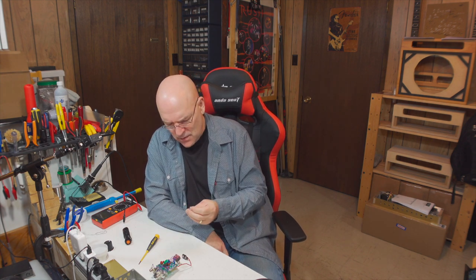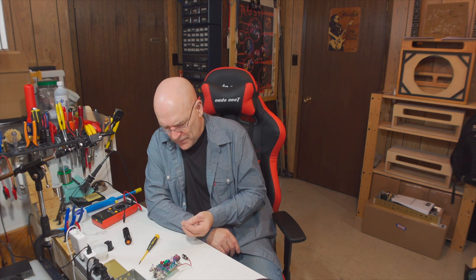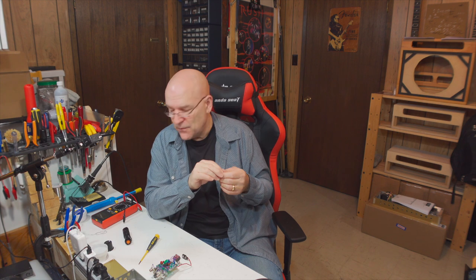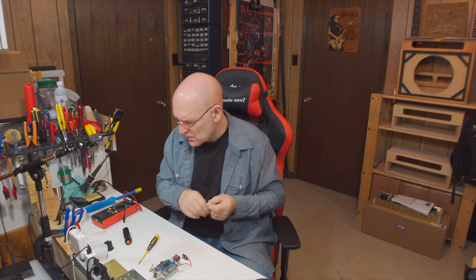Like I say, on a pedal like this, it's only 9 volts and not a lot of current is drawn through this pedal. This component probably took that brief instant of power being applied without any issues. It probably hasn't failed. That said, you want to make sure you're not putting a bad component back in. So I've taken this out. I'm going to turn it around, put it in the right way. But before I do that, I want to make sure that this capacitor is working.